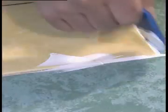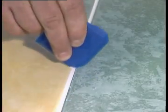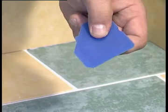That's another advantage of the Fugi set because you don't have to work a parting compound into the joint or into the leftover silicone. Just scrape off the material and keep using it. Clean off the Fugi with a normal paper towel, for instance, and it looks like new. The material won't stick.